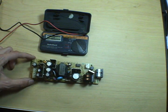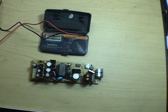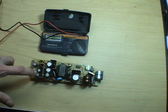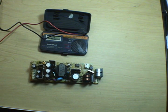There's other components on there too. There's transformers and a couple of big old rectifiers. Those are pretty robust and usually they don't go bad. The electrolytic capacitors though, these are the guys with the shiny silver tops and the plastic sides. Those actually have a liquid electrolyte in them that over time can dry out. And the cheaper the capacitor is, the faster it'll dry out, or it could just fail altogether and explode, but obviously that hasn't happened in this case yet.